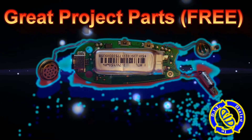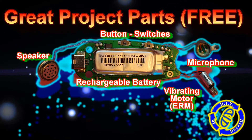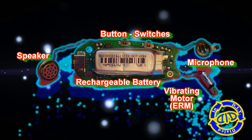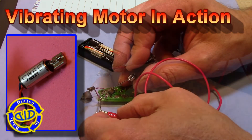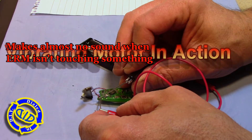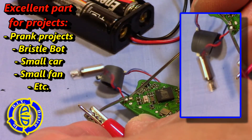Any of these devices salvaged intact give you a great rechargeable battery, but let's start by taking a closer look at that vibrating motor or eccentric rotating mass motor. What I've done here is I've taken some old AAA batteries, hooked them up to some alligator clips, and at the end of the alligator clips I just put a couple of long T-pins in there to use as probes. I'm then going to touch the connections for the eccentric rotating mass motor and show you how it looks and works.